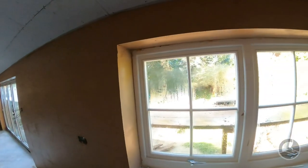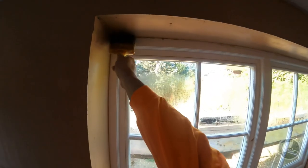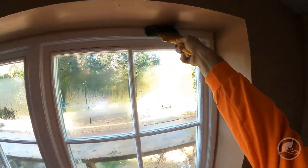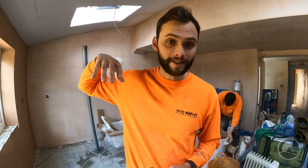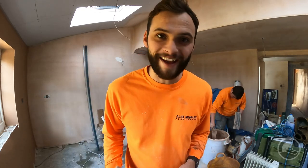If we have a look at this door frame here you can clearly see plaster around the reveals is still wet, which means on the window frame it will be as well. If we just run the brush along the window - don't worry about whether it scratches the plaster at this stage, it doesn't matter. Certainly before we apply the second coat I'm going to go over again with the trowel just to flatten that in. It just takes out probably 95% of the plaster off the window frame straight away, making it a lot easier to keep it clean towards the end of the set.